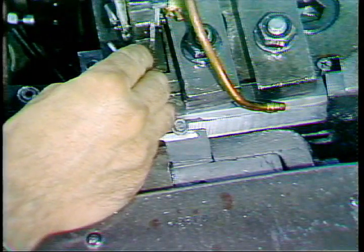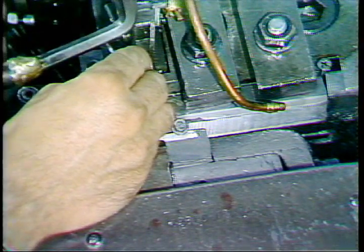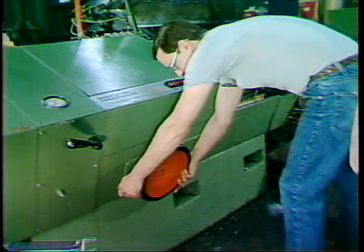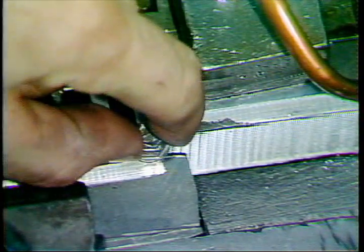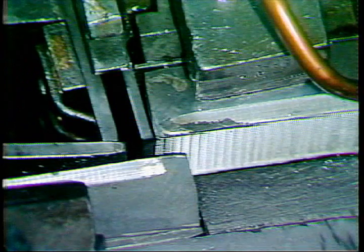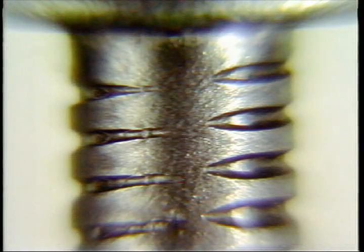Make a mark on the blank head on the side facing the stationary die. Now you must roll the blank back out of the dies. Retract the starter finger so that it does not push against the blank. Since the ram cannot be jogged in reverse, hand crank the blank back out of the dies. When the blank is released from the dies, remove it and inspect the blank.